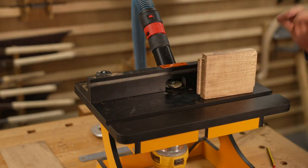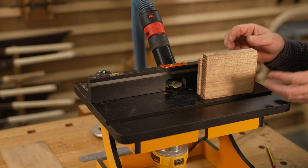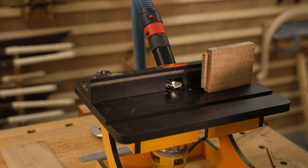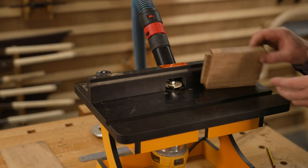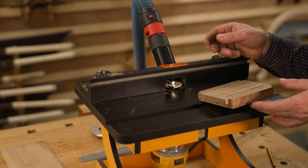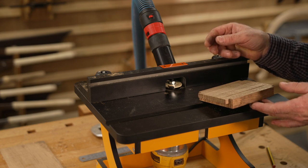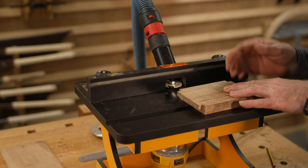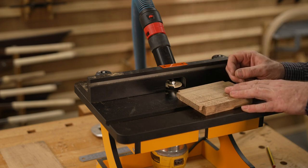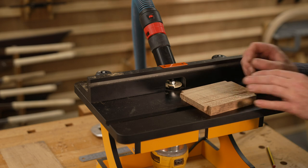Then we need to raise and lower the cutter fractionally. So you could work through these as a group, do all the cuts, then actually lower them will be good. All right, and you'll need to move the fence because we're going to do a 6mm on this one, 3mm on the upper facing shelves. So the top will have a 6mm, allows the shelf or the back to lift up and go in, and it will drop into the shallower 3mm groove.